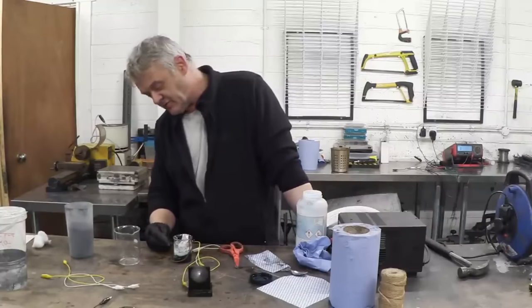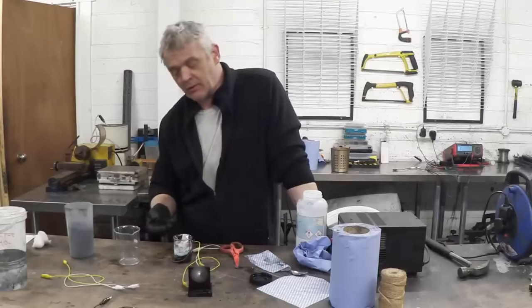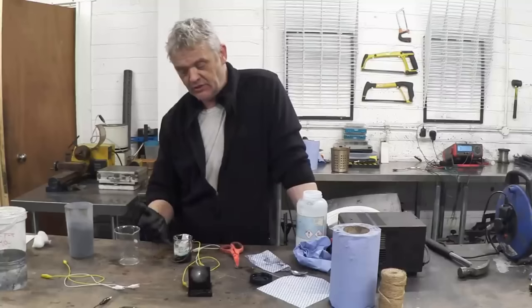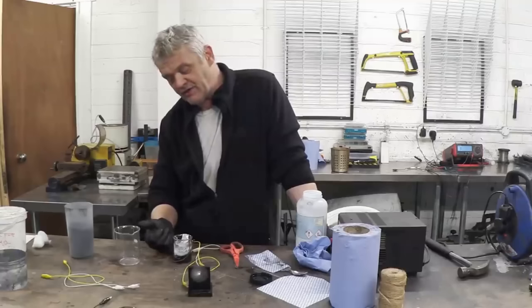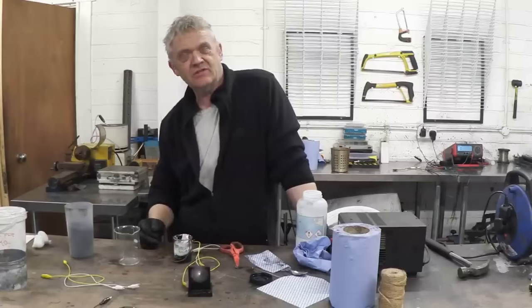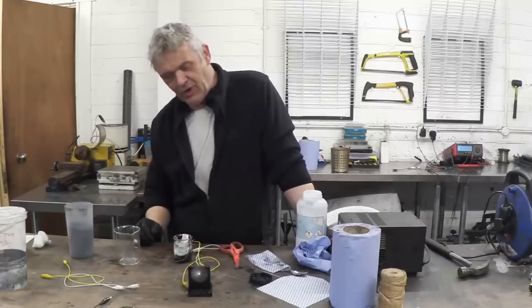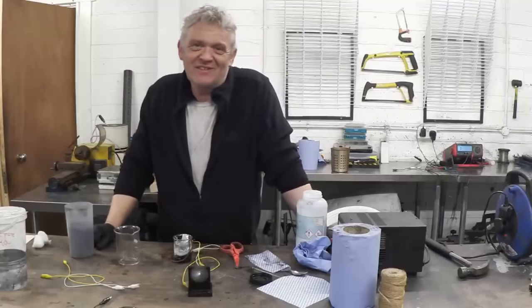Now the idea is that the copper sulfate is assisted to stay in its boundary layer by being adsorbed onto the active carbon surface. So that will keep this nice and clean and controllable as a boundary layer, and this as the copper sulfate layer. The cotton isn't strictly necessary, it's just that I didn't pre-soak it, so it will float until it gets to be pre-soaked. But I can see that you would use that in the halide battery as well. And that particular idea comes from 1903.